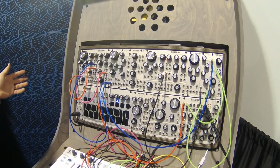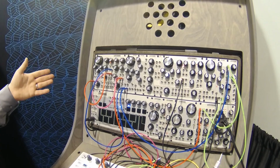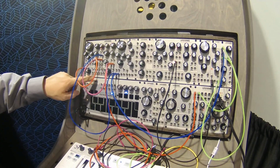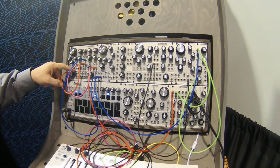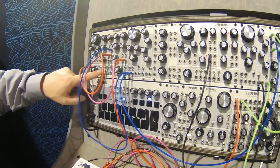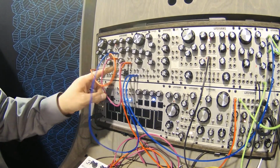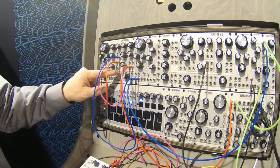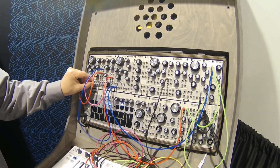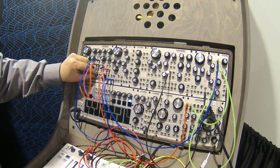Both oscillators have full wave shapers. Oscillator 1, you have our Pittsburgh Modular blade wave and a modulatable pulse width. All of the CV is handled in the bus matrix down here. So it's two channels, A and B. What that lets you do is you have frequency modulation for 1 and 2, pulse width, and you just switch between the buses. Let you experiment with some sounds, route things around maybe in a way you wouldn't have thought of. Get some very interesting sounds that way.